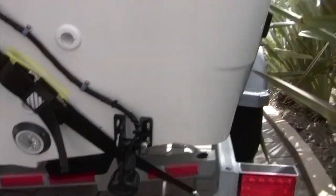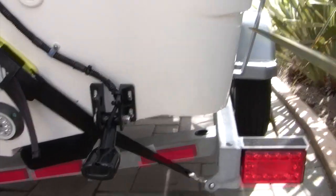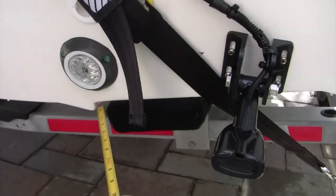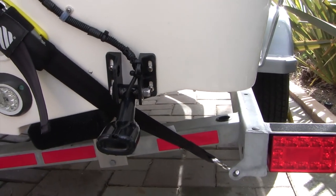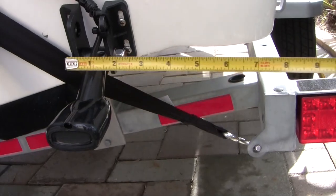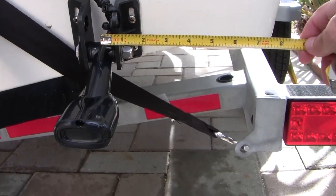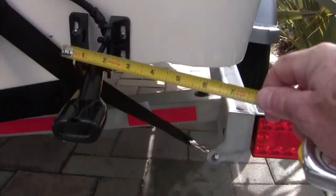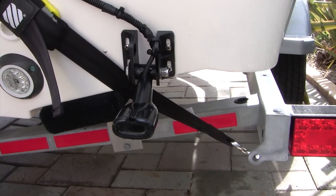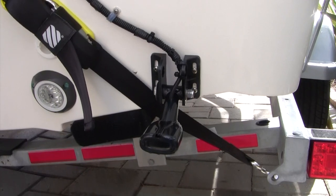A couple of items to point out here: first, the location of the transducer for the fish finder. A lot of people are always asking us where we place ours. You can see the strake right there. This is a transom light — we've got two of those that we can flash white and blue, great for helping to make bait in the morning. From that fold in the hull it's approximately three and a half inches in to center, right from that fold where flat meets the dead rise angle, you've got the 5200 transducer. We are running a Lowrance HDS 9, which has been more than adequate for our needs.